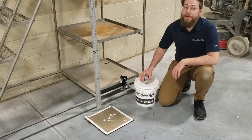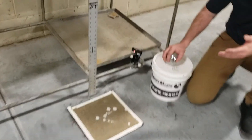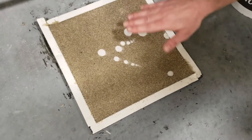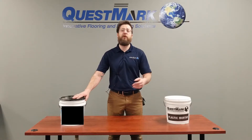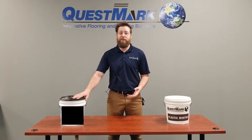We're seeing some pretty incredible results from Questmark's epoxy mortar. If you take a closer look here, you'll see we have essentially the exact same thing — where the ball hits, it flattens out the sand, creates no cracking, and also remains completely level where the original patch was laid. The cementitious patching material began to fail only at the four-foot drop. At the six-foot drop it failed even worse, and at the eight-foot drop it was completely and utterly coming up from the concrete.